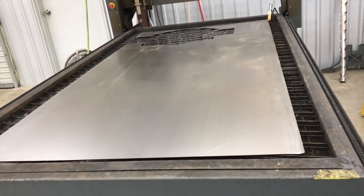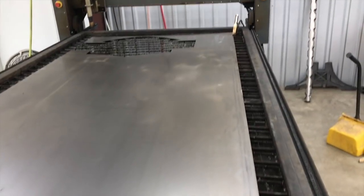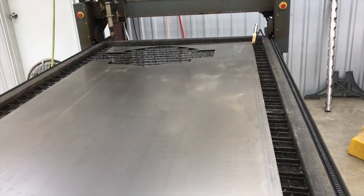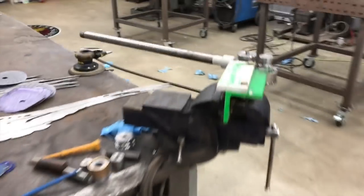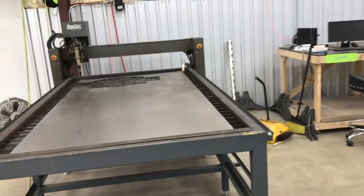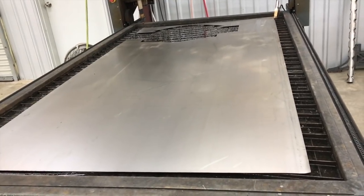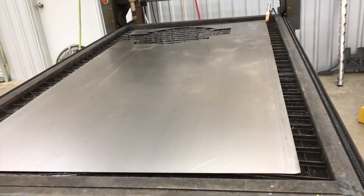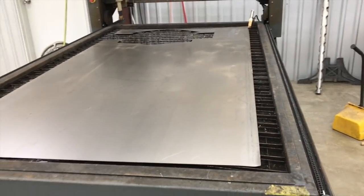The good thing about leaving the oil on it is that water and stuff that comes up on the table, if you don't prep it right away, won't rust on you. I'll show you. Well, I don't have any out here, but you see that right there? That'll be all over it. And if you leave it for enough time, it's pretty corrosive. It'll already start to pit. And because I'm using the surface of the bare metal in the flags and so forth, it's important to have the metal looking really clean, bright, and look as good as you can, because whatever imperfections are in it, you're going to see in your final paint.